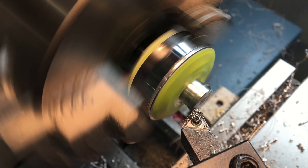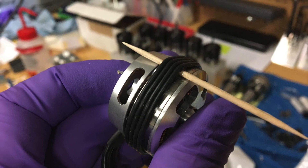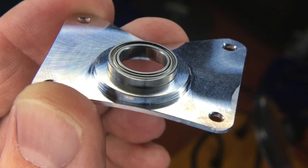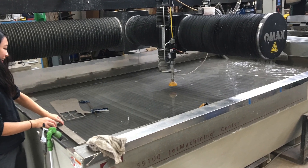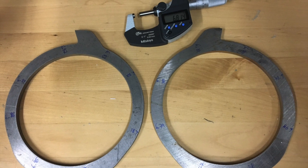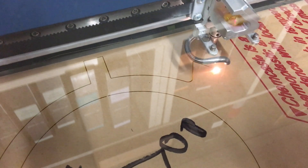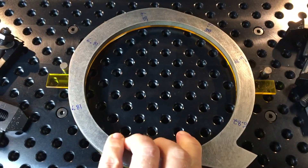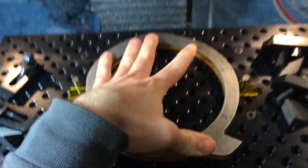I did a few operations on the motor to modify it to fit in the robot — I glued O-rings on and machined little plates to hold the weapon motor in place, and press-fitted the bearing. Then I had my S7 steel rough cut on the water jet cutter, but I needed finished surfaces on the inner and outer profiles. It was critical to have a precise diameter to run against the bearings, so I laser-cut a jig to get X-axis positioning and approximate center of the weapon ring with an edge finder.